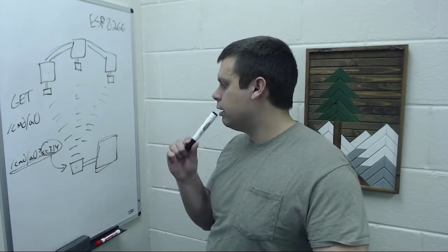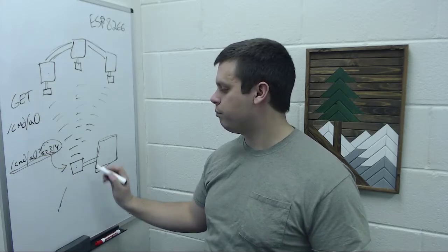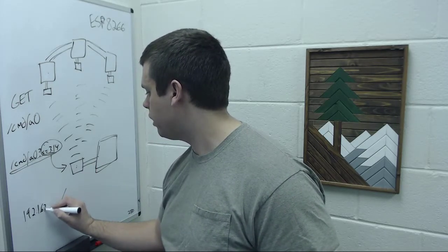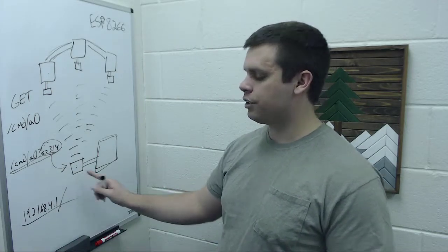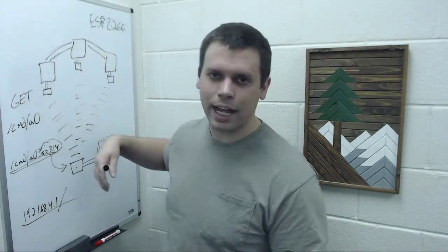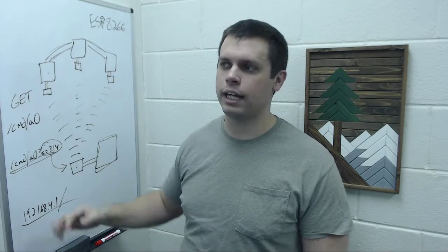This now has an index route. So here we've got CMD A0 as a route. If you just go to the index of the page, the server's internal IP address is 192.168.4.1. If you go to this URL, if you're connected to that Wi-Fi network, then it pulls up an HTML page that has a table of, here's the last command, here's the last time I received a command, here's the last state, and again for each of these actuators, and here's the last time I received a state.